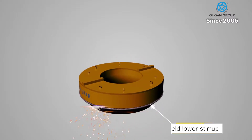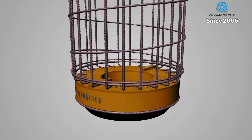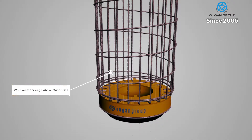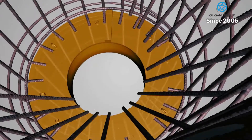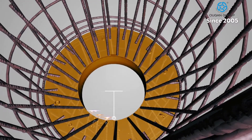The Supercell set is welded into its base frame in preparation for placement in the rebar cage. Diagonal reinforcement guides are welded onto the rebar cage to guide the tremie pipe past the Supercell and to even the load distribution on the top and bottom of the Supercell.